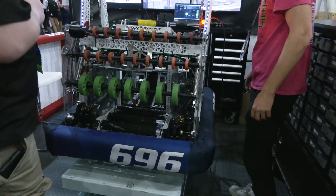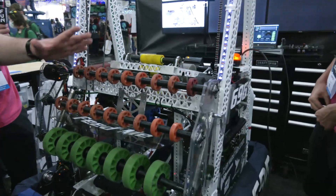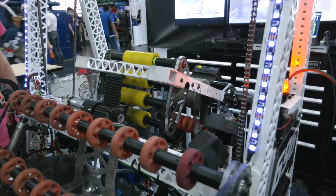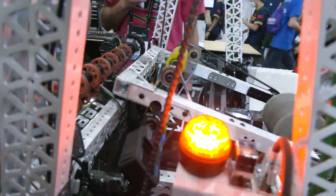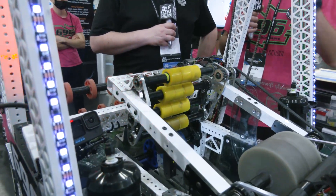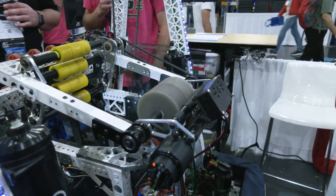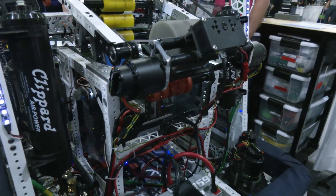Let's go into your shooter. Talk to me about concept and design. Your team is swerve drive — no turret — because your swerve drive handles aiming well. Our shooter has had a few iterations. The main thing we changed from our first competition is we ditched the linear servos driving the hood and opted for a Johnson PLG motor, which is much faster and more durable — those servos just kept breaking. We have this so we can essentially shoot from anywhere on the field, with the Limelight controlling the hood angle, flywheel speed, and aiming the robot left and right.